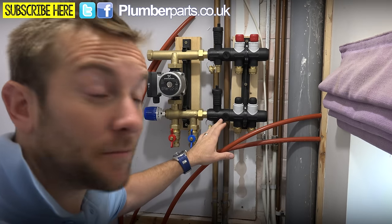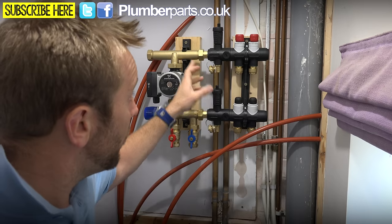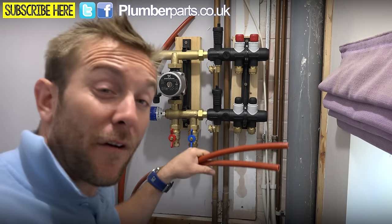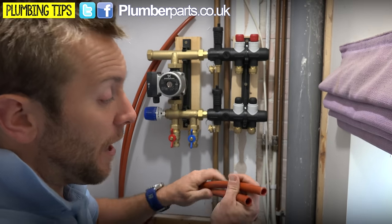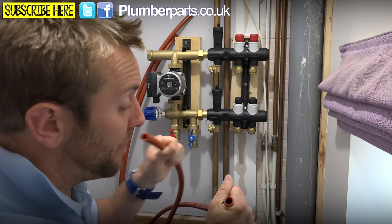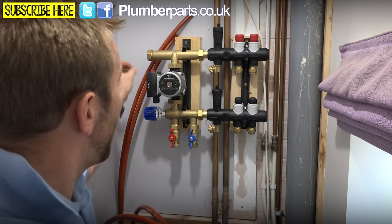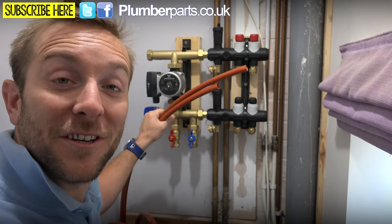And then we've got our two loops that need to go into our two manifolds just here. It's very important that our flow loop goes out there and our return loop comes back up there. Because I've only got two loops and they're both to the same room, it's really simple for me to find out which one's which. If I just blow down that one there, I can feel air come out of that one, so I know that I've got my flow and return loop there. And then obviously, with a bit of detective work, I know that that's the other two loops I've got.